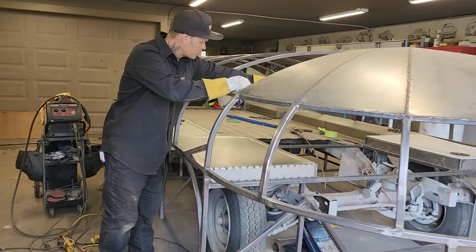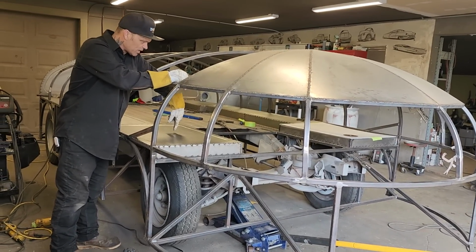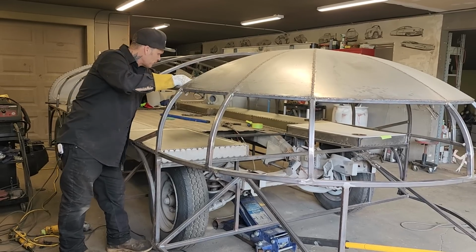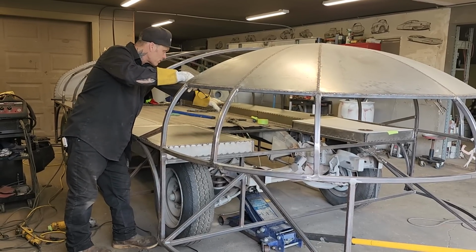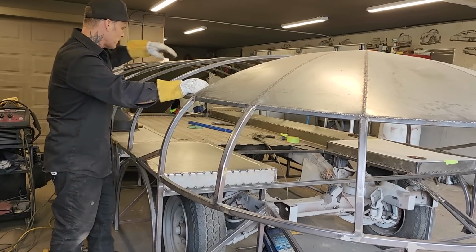We're going to put plate on that side, so when we jump in, we're going to step on plate and it's not going to bend. You would never want sheet metal there to stand on. If you did, you'd want to support it. I'm thinking checker plate so it didn't get slippery or something like that. And then we're going to end up studding this part up. I'm not going to cut that center. I'm going to stud that across there and put some plate there too, because it's going to be two-step, one step, two-step down into the front to drive this bad boy.